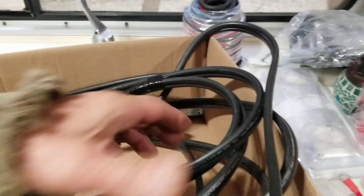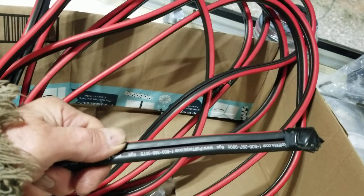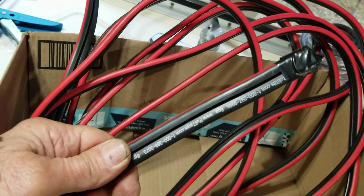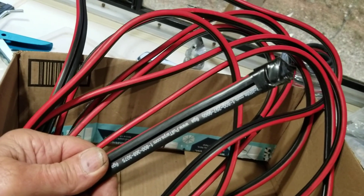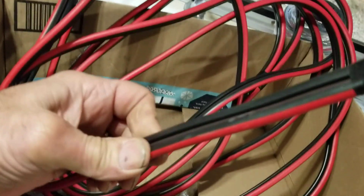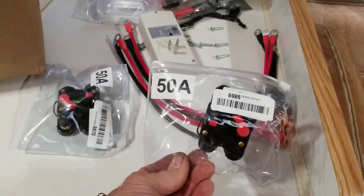This is really neat stuff. My son builds dump trucks from the ground up — he works for a company called Rogue Truck. They're the best transfer dump trucks made in the country by far. This is number four multi-strand wire used for an electric tarp that retracts on those dump trucks. When a section isn't long enough for the full truck, they throw it away — 23-foot sections all the time. Matt grabbed one for me and it'll work great coming down from the roof through a 50-amp connection, then to the charge controller and out to the battery.